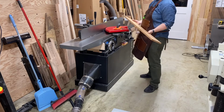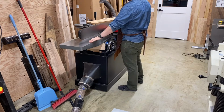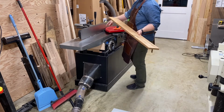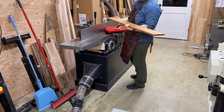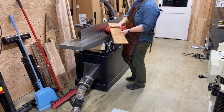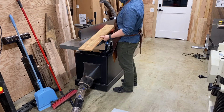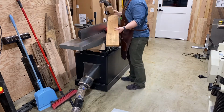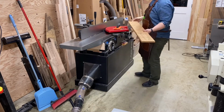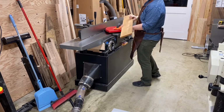What I was trying to say was that I wanted all my weight out here because this is your reference face. This is not your reference face because of where the blade's positioned; this becomes your big reference face. I find that the more pressure I can add over here, so not adding any at the very front, is important. And when I have wood that's gliding well, I prefer the grapevine, so paddle over paddle, a little bit more.